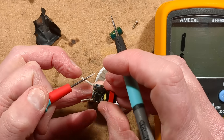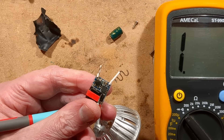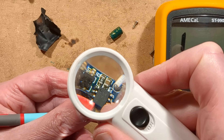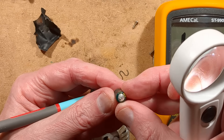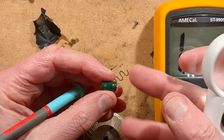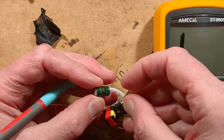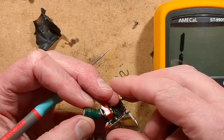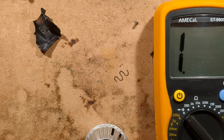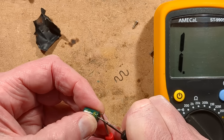To fix this would require a change of capacitor and the rectifier at least. Is the chip failed? It usually takes out the current sensor resistor — the little 3.3 ohm current sensor resistor there — but it looks intact. So I think the capacitor has given up the ghost. It is bulging, which is unusual because although it's a high voltage — 400 volts, and in the UK it goes up to about 350-ish volts — this capacitor isn't dealing with the super high frequencies that the other capacitor on the output usually does, in this case the little ceramic capacitor. So they usually don't suffer damage, but in this case it has popped.